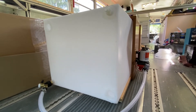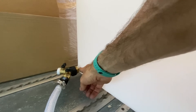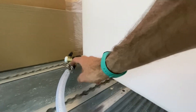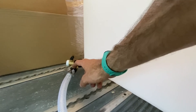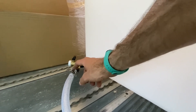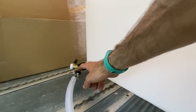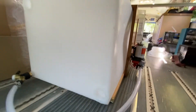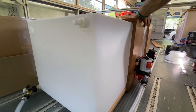I saw a lot of people do much more complicated things, and I don't know why. In order to interface with this adapter — this is a half-inch female NPT — I needed to use a female-to-male garden hose adapter. And then this other one is a half-inch NPT female barb fitting, so I needed to use another female-to-male NPT garden hose adapter. That's it — super simple and straightforward. And then I can take this and move it and place it anywhere I want in the bus.